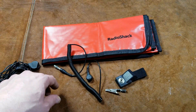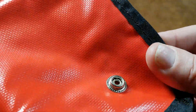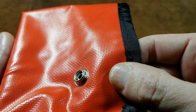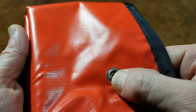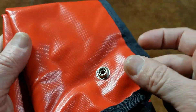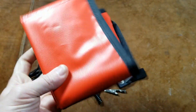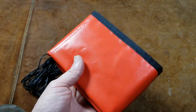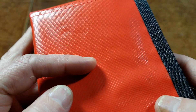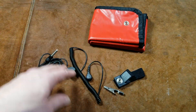They're set up for electronics because the way this works is we have a snap — I believe the vinyl has carbon or something mixed into it, so it's electrostatically conductive. It just has a metal button that's been pinched to it, and they do put some nice embroidery on. It's pretty heavy vinyl, so any decent one you're going to get is going to be probably a half a pound for the mat by itself. We can see it is decent because it is a reinforced mat, not just a plain piece of vinyl.